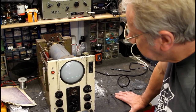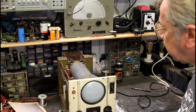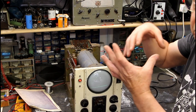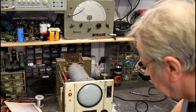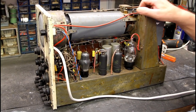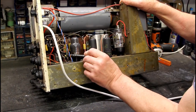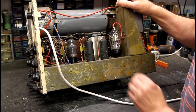It's an ongoing project but it's a nice thing to get going - at least we've got something on it now and it's actually working, which it wasn't before. I took the tube out, cleaned it up because it was grubby, and put it back. I thought I had it straight but it was very loose so I had to repack it at the back with rubber - at least it's solid now but I still haven't got it quite parallel. Basically all the capacitors have been changed apart from a couple over the back on the timing for the time base. The mica capacitors tested okay - not suffering from mica disease.